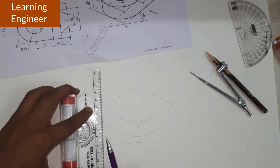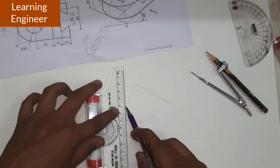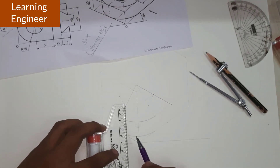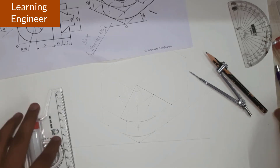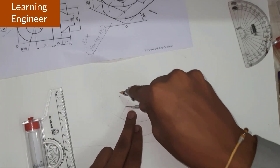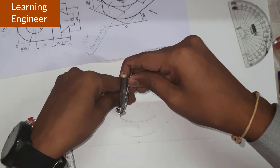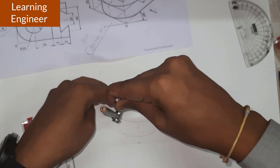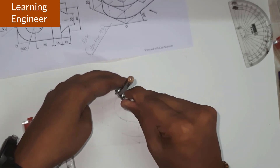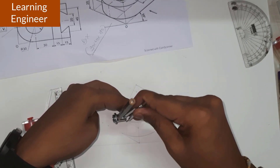For this particular arc, again I have to come 20 mm below, so directly I mark that point. From there, 20 mm below, I mark that 20 mm in advance. Take this as the radius and complete this particular object. This is how we have drawn the circle and we come 20 mm below to complete that object.